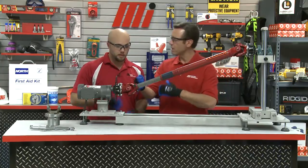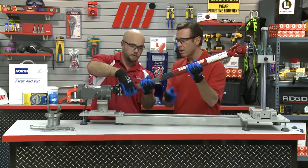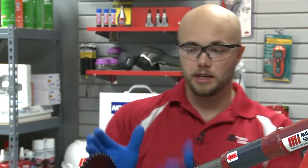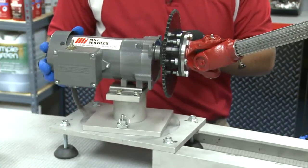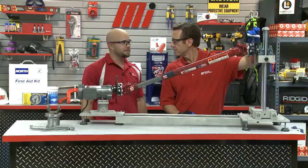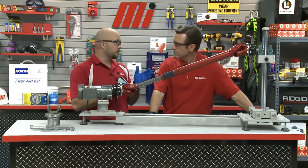Let's put it back to normal again and show the other way that people don't realize things are going wrong. By the arrows — as he said, line them up. We just line up the arrows, and now I'm properly phased and ready to go. Now we're going to introduce a non-parallel flange face. I'm basically just going to pivot this motor a couple of degrees to introduce a non-parallel flange face. You didn't move it that much. No, not much. But you're going to see how much that actually affects the operation of this drive shaft. I'm on my drive side — everything's good. I'll try it on your side. There's that noise again. Just from having non-parallel flange faces. The customer should be aware that having those flange faces parallel and the correct alignment criteria when installing this is very important for running the machine.